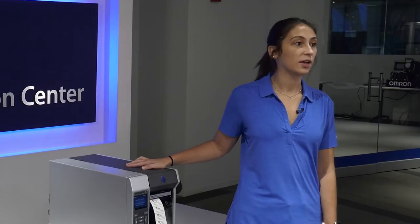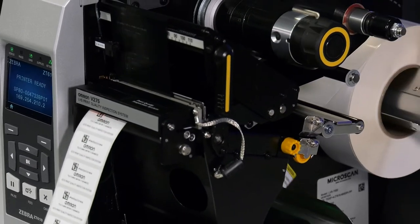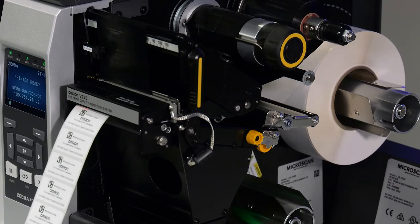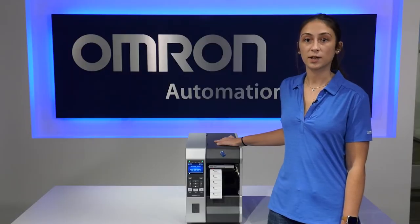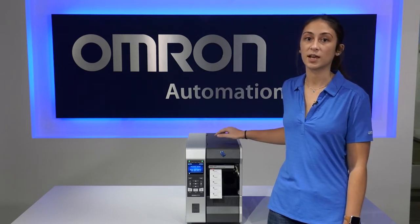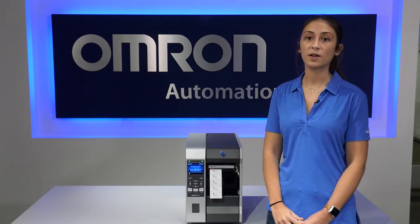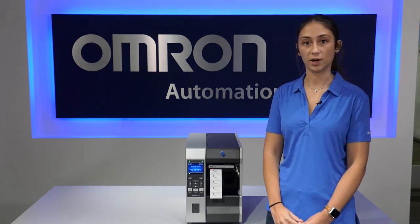The technology here is a complete solution that is Omron factory integrated, using a Zebra ZT600 series thermal label printer, together with line scan camera technology. It includes complete inspection software with the user interface and inspection analysis to ISO 15415, ISO 15416, as well as GS1 standards for barcode quality grading.